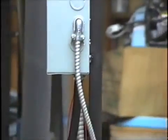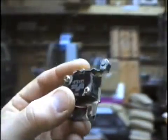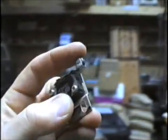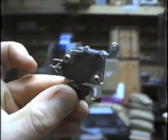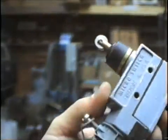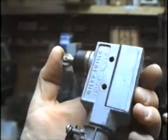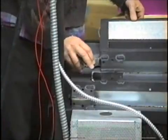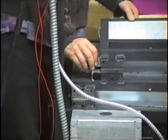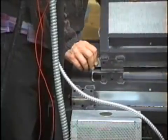The final thing that needs to be done is the lid switch. These little micro switches with a roller are about $8, but there's a version inside a housing that I'm going to use — I scored some used ones. They're available from an order catalog for about $40 in the housing. I'm going to mount it right behind the hinge on the gathering port lid so that when the lid is open, the switch will be activated and it will turn off power to the unit.